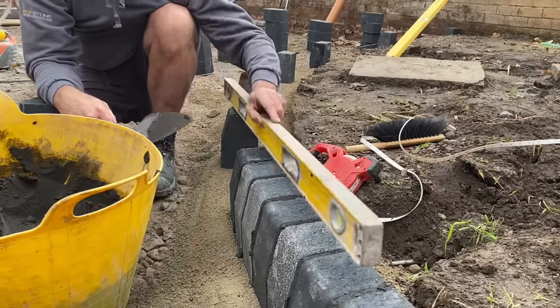It's important, anyone who doesn't know, most people will, to prop up your line higher than any fixed edge that's in. So I've just got a pair of scissors there, take it up about 5-6 mil to allow for compaction. If you set it to that height and you whack it, it's going to be below the finished edge there. So that's our height, that line running through.